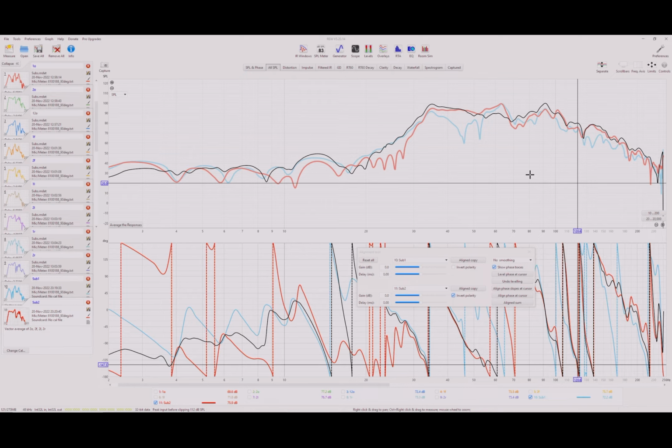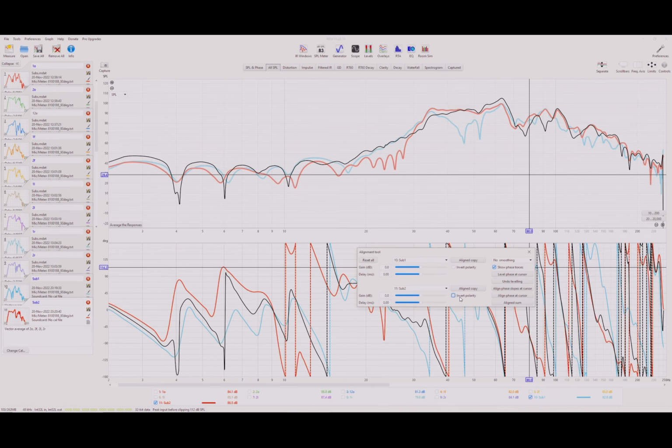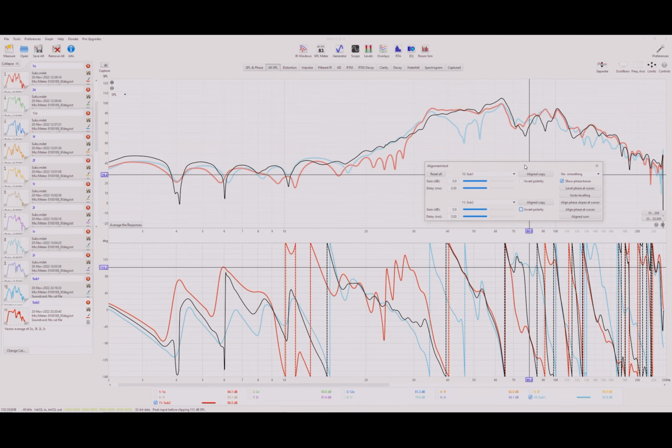In my case, I don't like crossing over above 80, even in a home theater system, because above 80 Hertz, the human ear can localize the bass. So take ceiling sound: when there is a bass that has to come from the ceiling, but it's too loud for the ceiling speaker, if it goes to the subwoofer on the floor, it doesn't really sound like it's coming from the ceiling, and you lose the Atmos effect. So I push my speakers to produce frequencies above 80 Hertz. Anyway, inverting polarity is not the optimal way. It is one of the ways, but we can optimize a lot better.